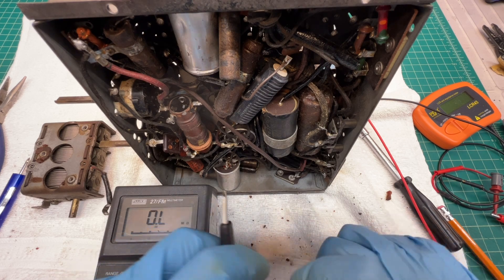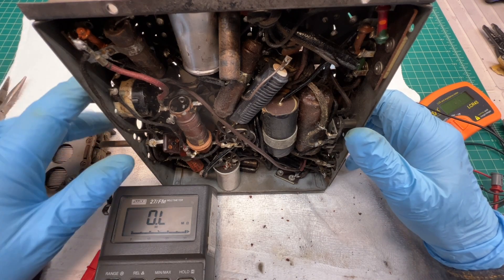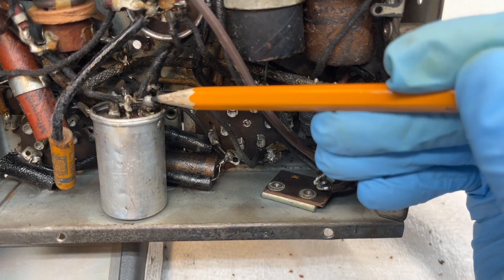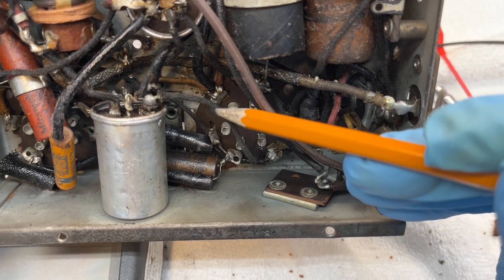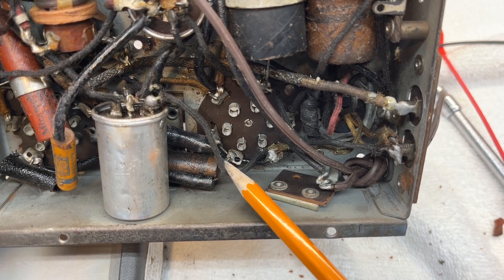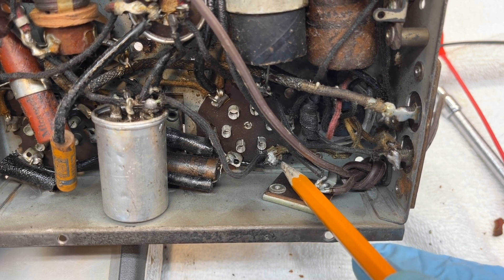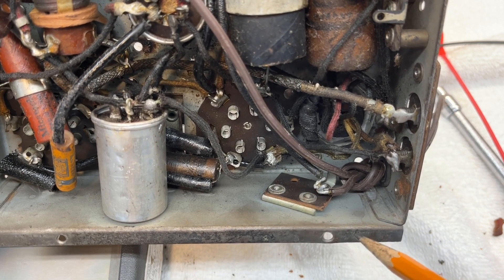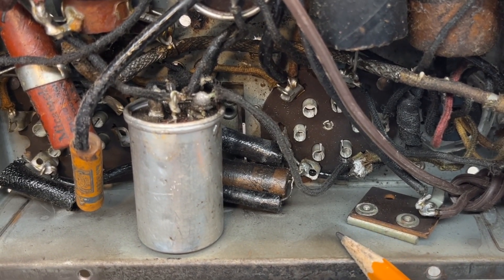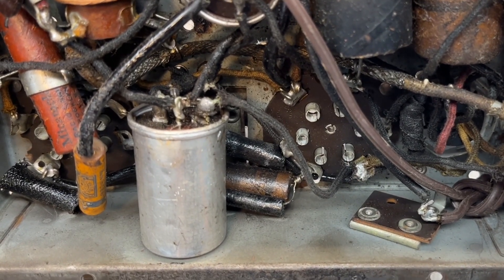I want to see how someone kind of re-engineered this thing, or attempted to, which may have led to the secondary actually opening up. Here's a clue: my primary winding is running left to right in a horizontal position, and you can see what looks like new solder. Someone has placed that back on the screen grid of the 6DL6 — pins 1, 2, and 3. You can see how it was soldered on; that definitely does not look like factory work and is definitely the wrong location on the primary side.